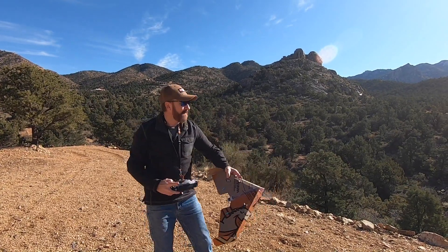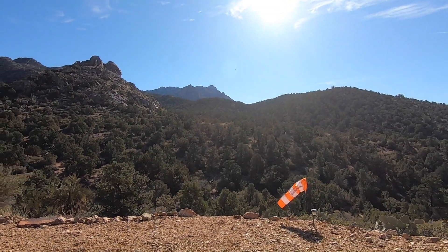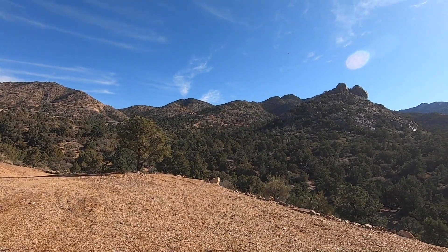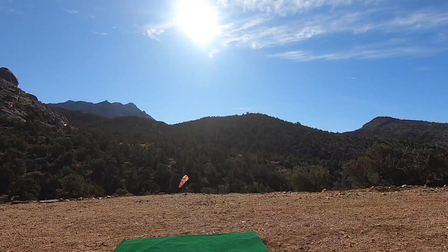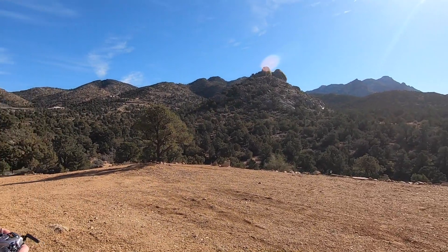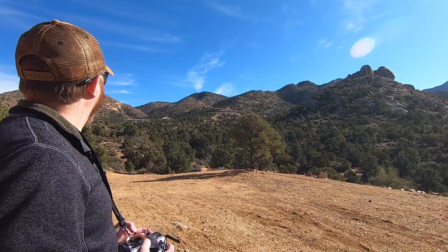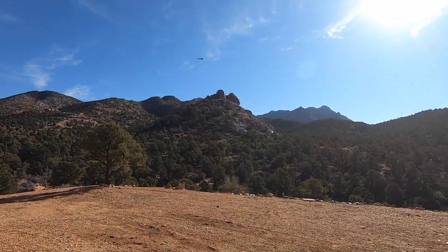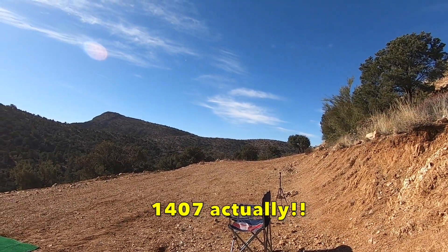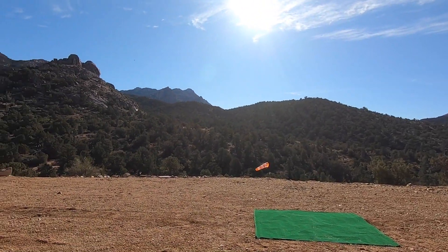She's flying! It's a lot smaller. It's actually flying pretty good — just a little squirrely. She's so tiny you can barely see her, but she's nimble. Little 1406 3600 KV motor on 3S. CG seems pretty good, probably flyable. I'll probably just leave it like this actually.